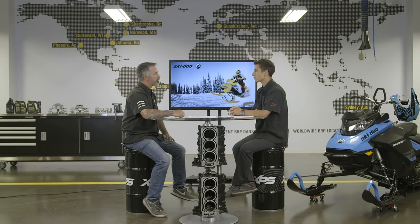Are there any other adjustments we'd have to do to ensure proper efficiency? Yes. Let's take belt adjustment in the driven pulley. We can compare that to air in your tires — if they're over or under-inflated, you can get premature wear. The same thing applies to belt adjustment. Good belt adjustment will give you better performance and better life on your belt.